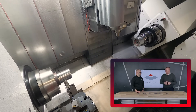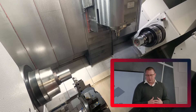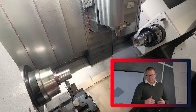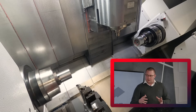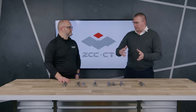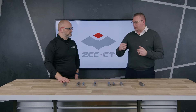With this new technology and new processes we've put in place, the YBC 103 is classified as a P10 — but it doesn't necessarily mean this is a finishing grade. We're actually achieving P35 territory, so the envelope is wider because we have such a strong substrate.